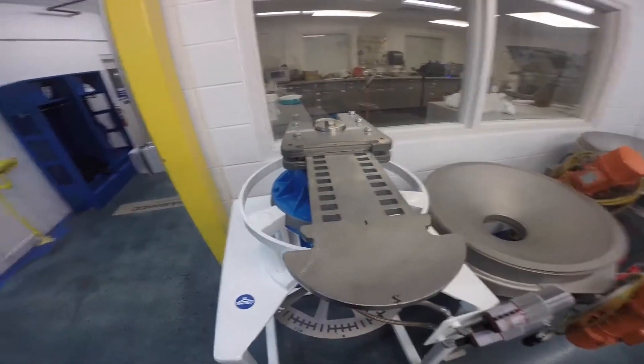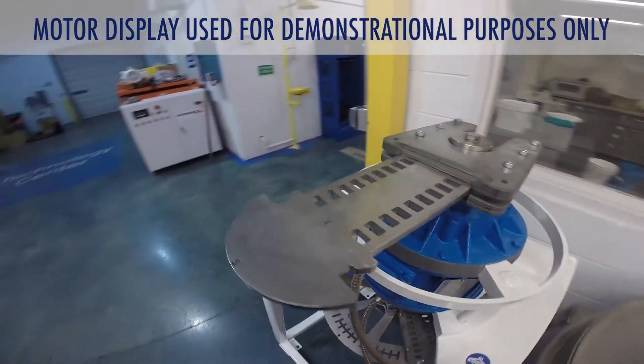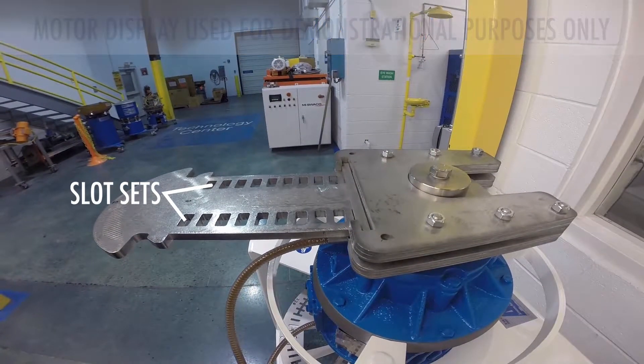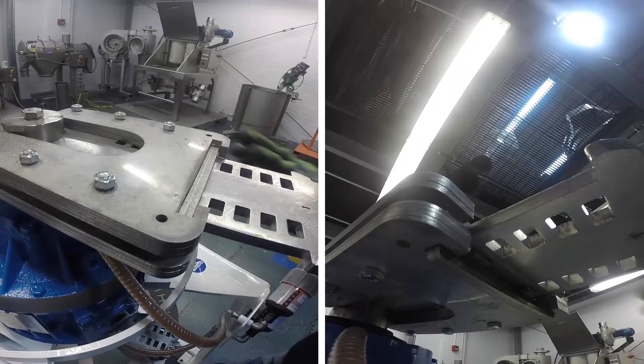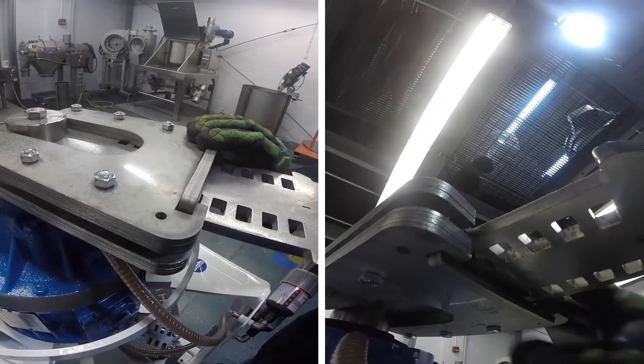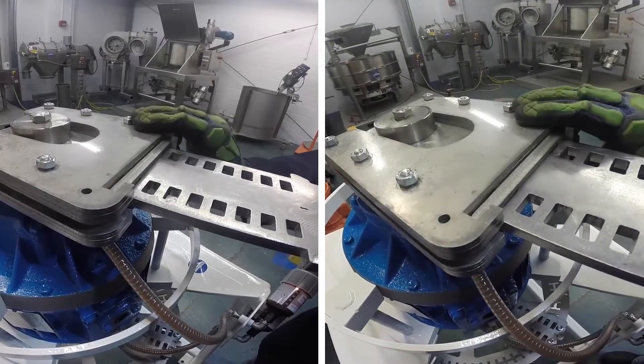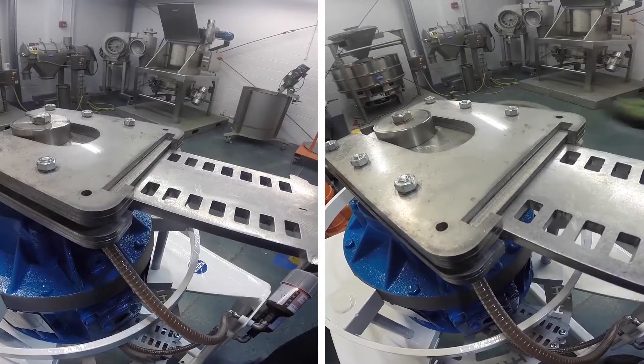The top weights primarily create vibration in the horizontal plane by adjusting the force. This weight arm has sets of slots that represent the force setting. To change the settings, raise the weight lock tab and move the weights until the tab aligns above the desired slot.